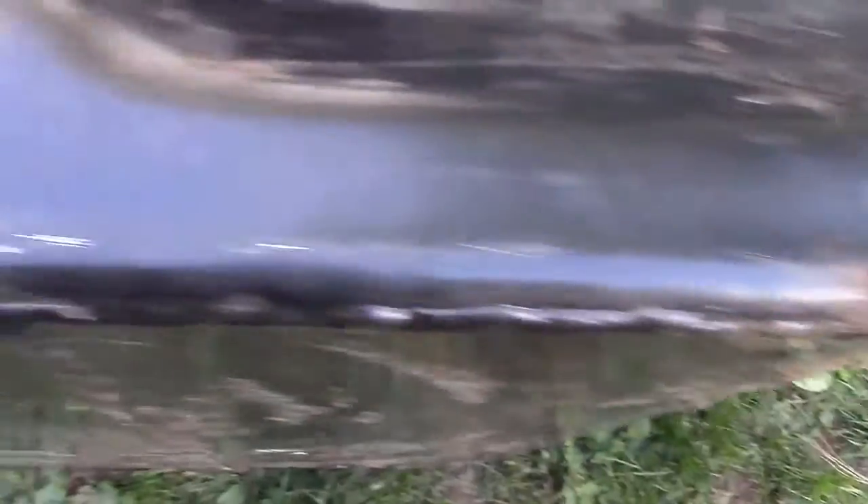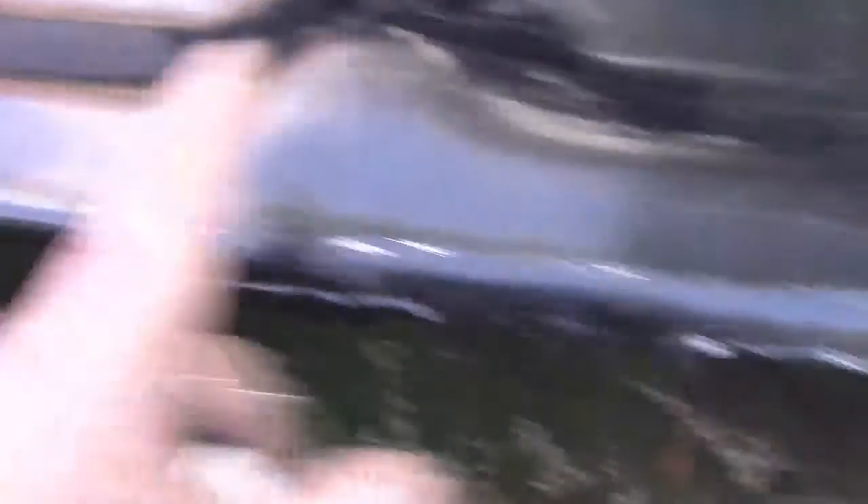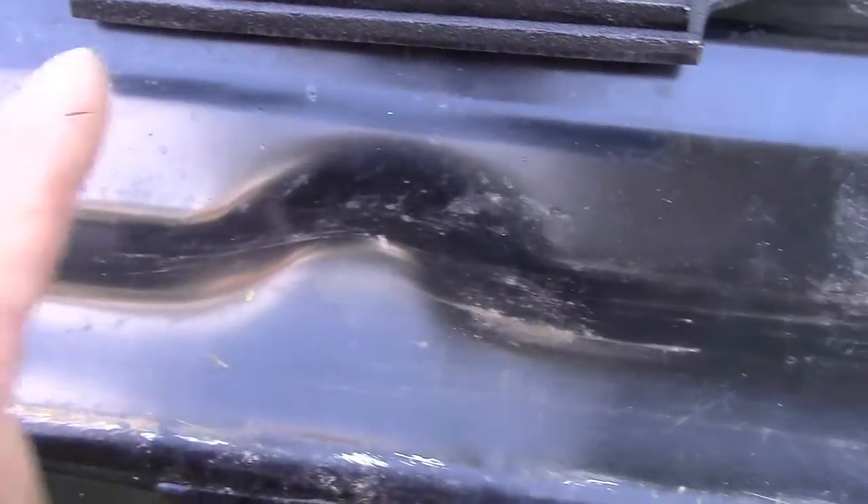I'm going to leave that out here and that's the way it's going to go. Down here, what I'm going to do is cut an opening right here — actually a little bit bigger, I'll probably go to here with it. I'm going to cut out an opening right across here, a couple of feet. I'm going to save this piece that I cut and hinge it. When I have to clean it out, all I have to do is open that up, go in there with a hoe, and pull out the ashes. That's going to make it a lot easier for cleaning. I've got a kind of worn-out flat hoe, maybe inch and a half, two inch. So if I just cut this out right on that seam, from here to here, put a hinge on it so I can open and close it — regardless if it's a drop hinge or a hang hinge — then I can use that for my clean-out.